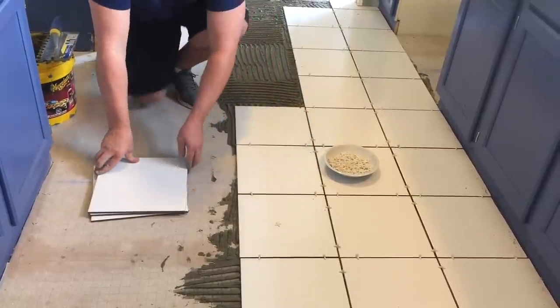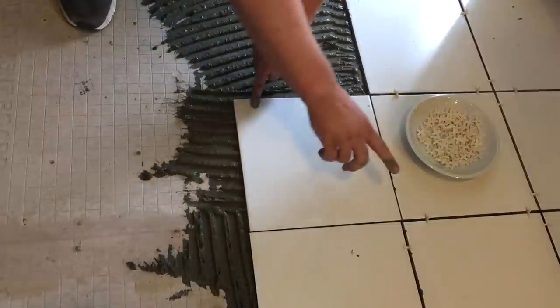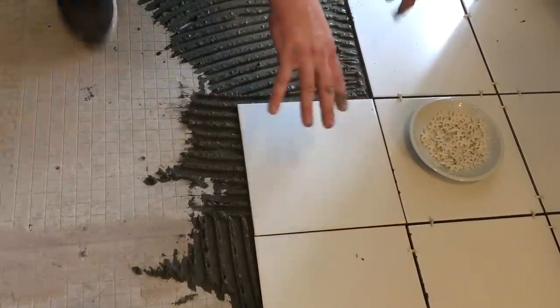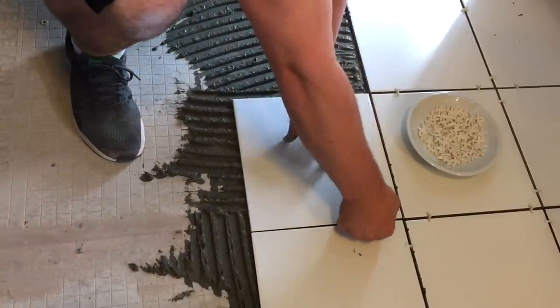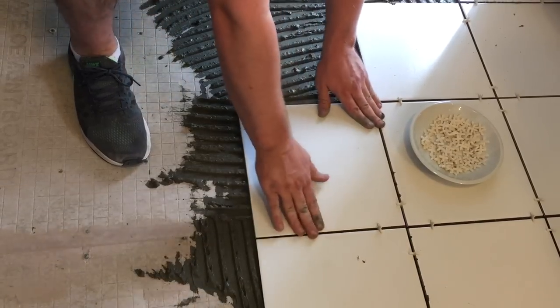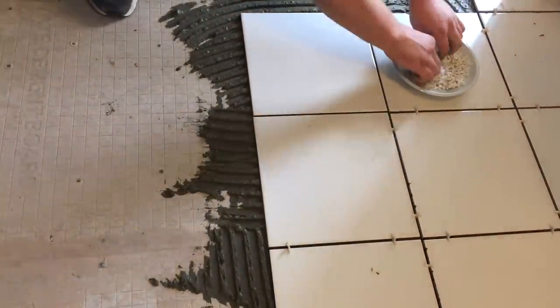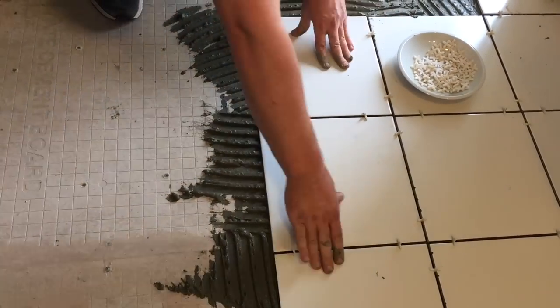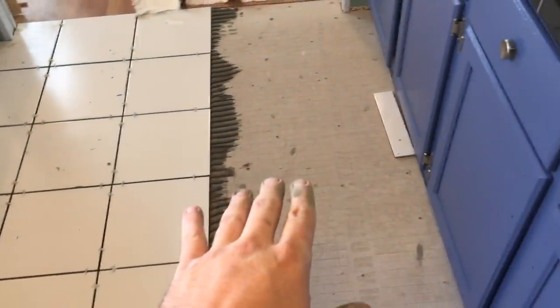This is about how fast it goes. If you do push on one side, one corner could be lower and the tile would raise up, so you want to push on it evenly and make sure it's somewhat flush and flat with the rest of the floor. Put these spacers in and just feel them with your fingers. There's the last one before I have to trim. Check down the line to make sure everything is somewhat straight. It's really a personal preference whether you do half the floor, let it dry, and then work on the other side, or just do the whole thing.